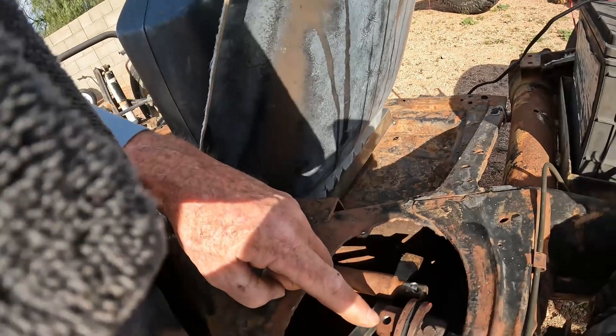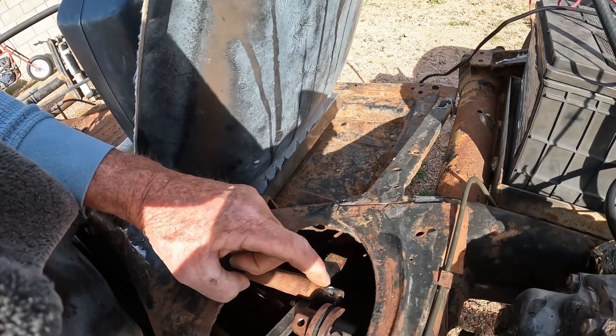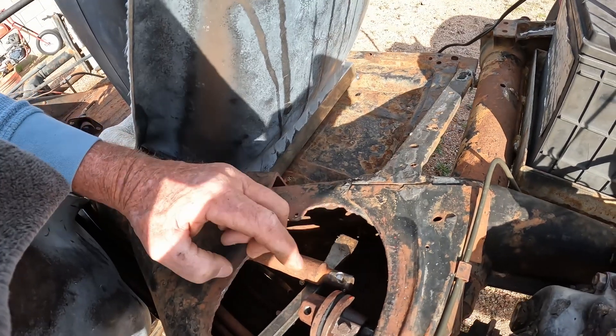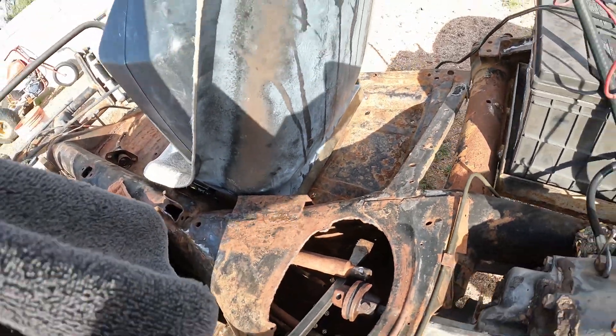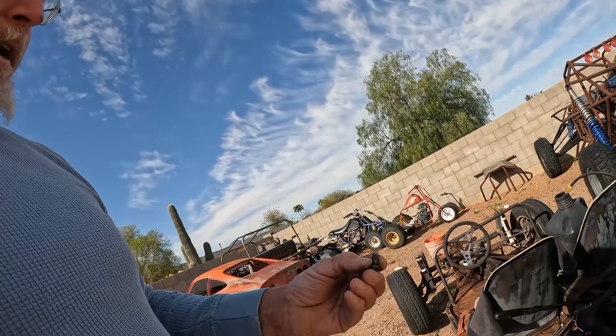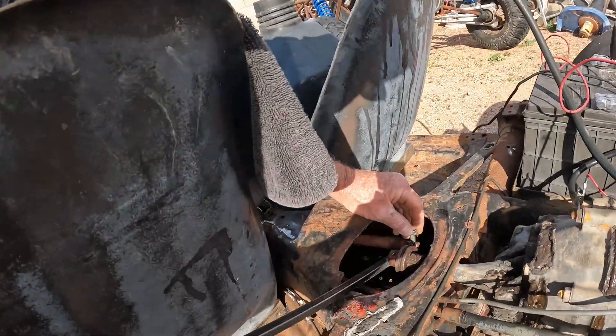I started taking the shifting mechanism apart this morning and immediately saw the problem. The coupler set screw goes down here, but the hole where that screw is supposed to go in was off — you can see how many degrees it was off. So what I did was I drilled that out, took the set screw, sharpened it up a bit so as I tighten it down it's going to end up going in there in the proper spot. I'm going to put this together and hopefully that solves the problem.